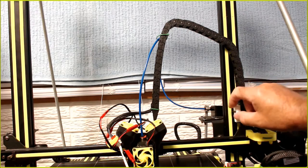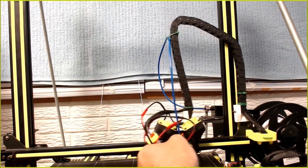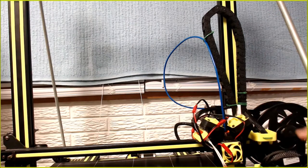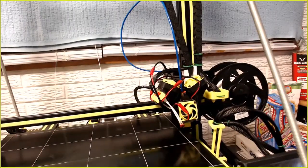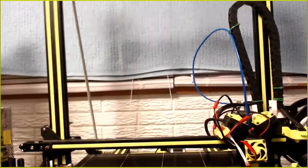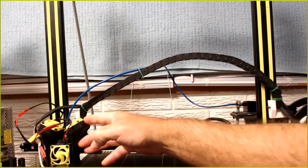The designer had nuts on the backside of these. I used internal inserts - the little threaded ones you melt in with your soldering iron - and that worked great for me. But as you can see, as it gets all the way over, the cable just touches the screw. If you look down here it's actually off the bed - it should never go this far - but if those little screws were gone it would never be an issue. You can also see I have Capricorn tubing on there, and this zip tie is just there to hold the Capricorn bowden tube. It can go full length until it clicks.